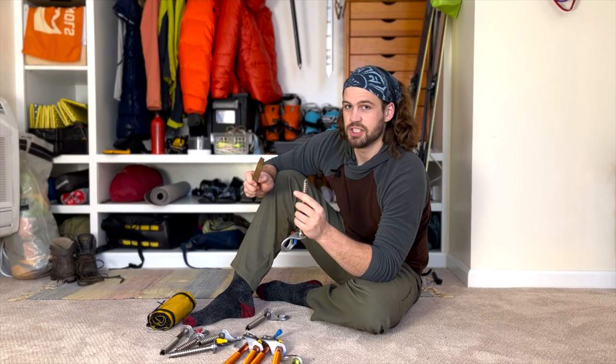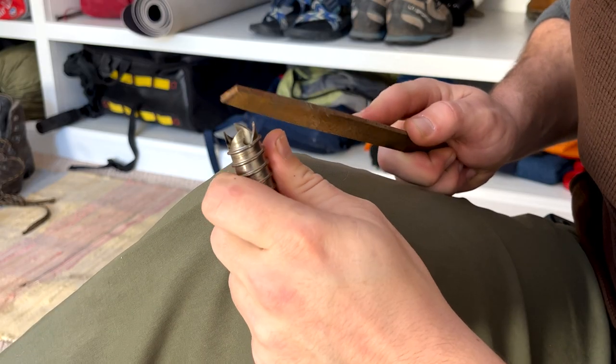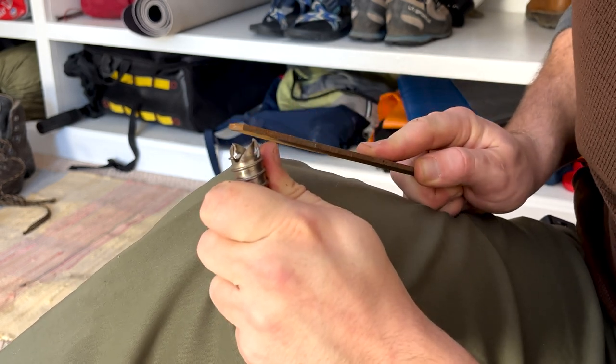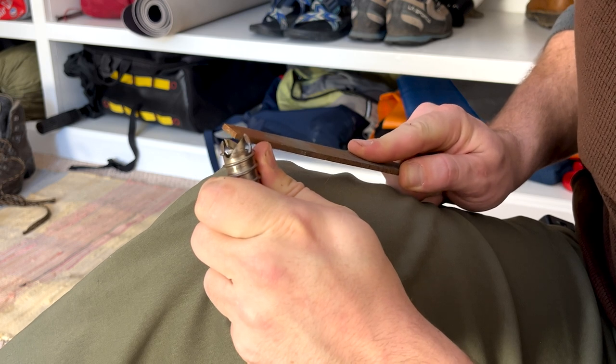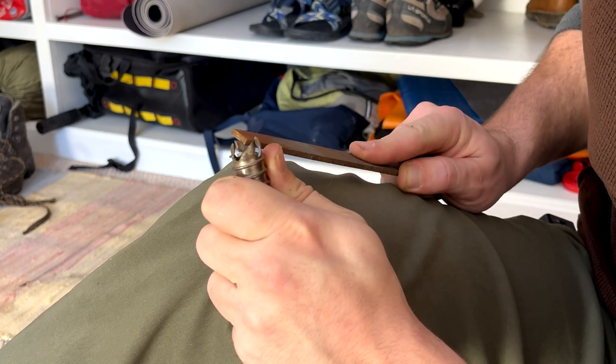First I'm gonna start by correcting the shape of the teeth before I try to sharpen them. For any tooth that needs its shape adjusted, I brace the screw against my knee and guide the file with my thumb. Each stroke should be at the exact same angle, and you'll see the fresh metal being ground away — it'll show you if your strokes are in the right place.